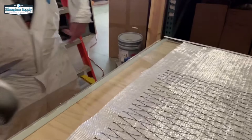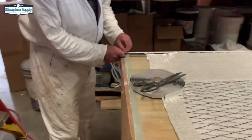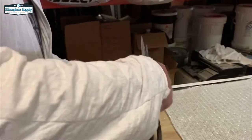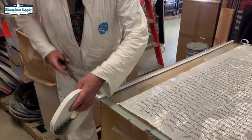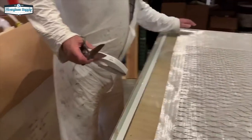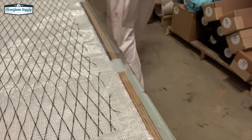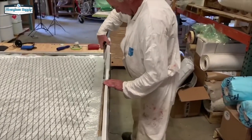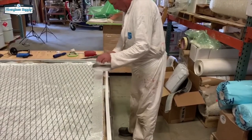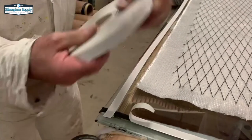Once the vector net is in place, he's putting down the sealant tape. Normally we would do that first before even putting the fiberglass fabric on. We've also prepared the glass by putting down some release agent — RNB Easy is the one we typically use — to ensure the epoxy does not stick to the glass. He's overlapping the corners and running his hand down to clear any fibers, because a stray fiber under the sealant tape causes a leak, and a leak can ruin the whole infusion.